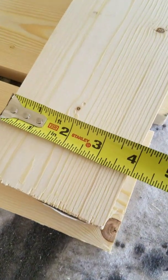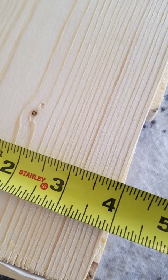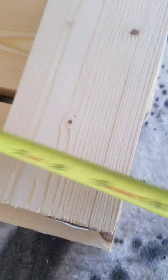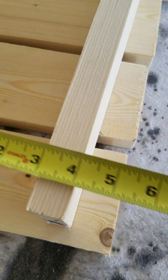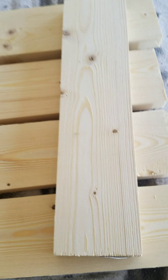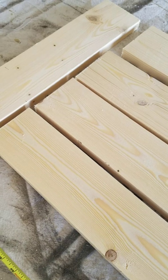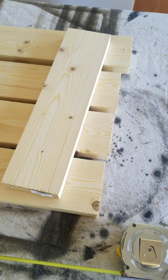Sometimes when you go to Home Depot, I recommend everybody take their measuring tape. The 1x4s sometimes are sold as 1 3/4. Or that's a 3/4. They usually cut off half of it. These are actual full-size 1x4s. You can see there, it's an actual 1-inch. But sometimes they are 3/4 by 3 1/2 or so. And you want to make sure that when you go back and get more wood, you're getting the same size. So 26 lengths by 16 1/8.